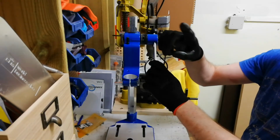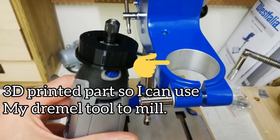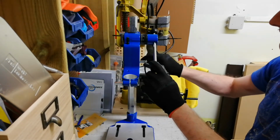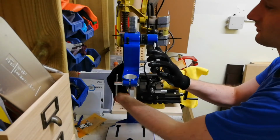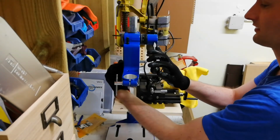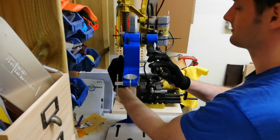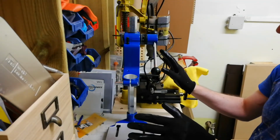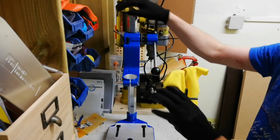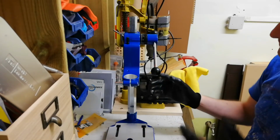Then the other thing is, and that's important if you want to mill with this thing, which is possible. So you need to tie these screws here at the left side. If you tie them up well, at the desired height, see, then it won't move up or down anymore. It is just fixed like that. And you've got two of them, so if you tighten down the two bolts, then it will stay in position and you can mill, no problem.